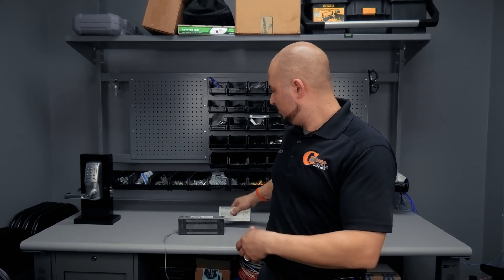There are two most common strength ratings — there may be additional ones out there, but the two most common are 600-pound and 1,200-pound electromagnets. The 1,200-pound are usually used on exterior doors, because you don't want someone or a couple of people to start pulling on the door and just force it open. So there's 1,200 and 600.